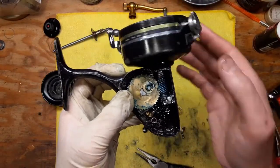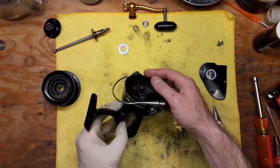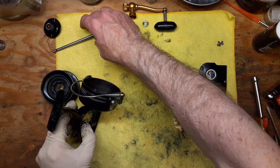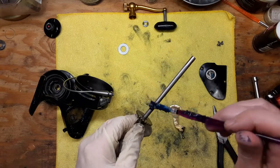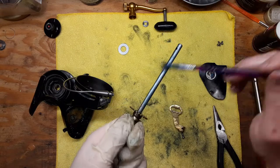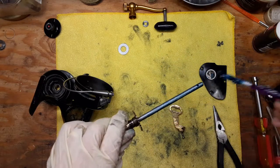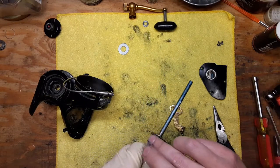You should hear that dog snap like that — that's a good sign. Now we've got our main drive shaft, axle shaft. We're going to take some blue grease to that. Make sure that you're using greases and oils that are made for fishing reels — I say that in all my videos. You don't want to use automotive grease. You'd be surprised how many reels I work on that are loaded with Vaseline. Don't use Vaseline.